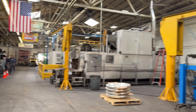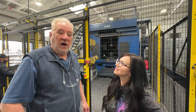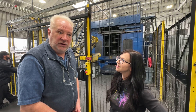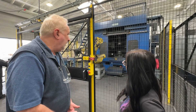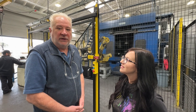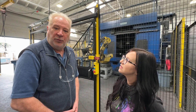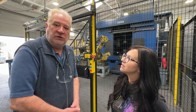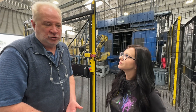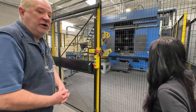What we're going to take a look at next is the spinning process. When the part is done being rotary forged, the next step is for it to be spun on a spinning machine. This machine loads the part from the robot and puts it into the machine, then it runs, and the robot unloads it. It's a spinning process that takes the forged part and turns it over a tool into the finished near-net-shape part, ready to be machined.